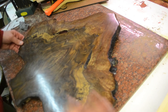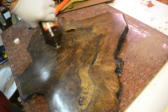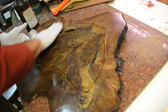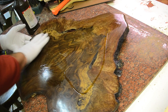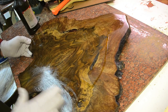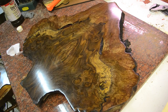Now I'll put a third coat on, and this one is going to get really, really smooth. For the third coat, make sure you've got a clean square, get your TrueOil, and put a light coat on across the piece — now you're going to get a nice build. You're just rubbing it in, making sure you get across all the corners. For these last coats you don't really need a whole lot of TrueOil, because like I said it's already soaked in — now you're just adding a build coat.